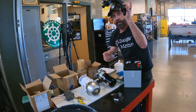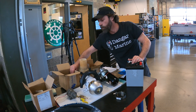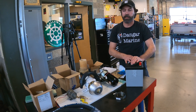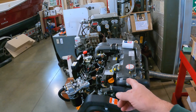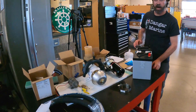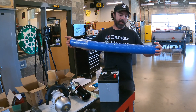We're putting in a vented loop for our raw water circuit to play it extra safe. It was marginal — we're above the waterline but not by much — and we don't want to flood this engine. That's exactly what happened with the old one, which cost twenty-seven thousand dollars.